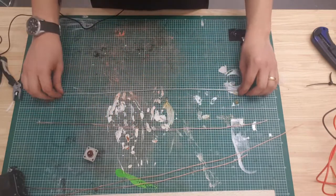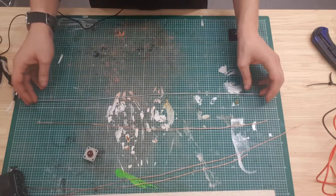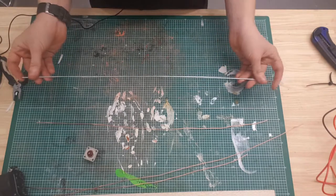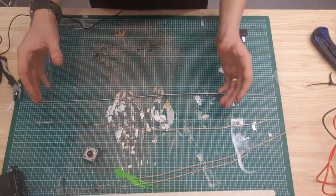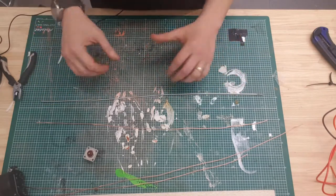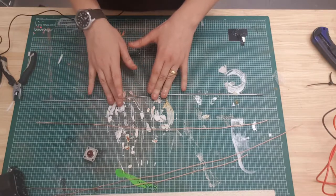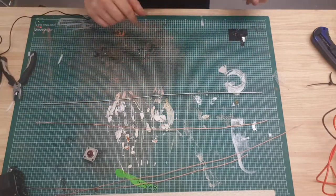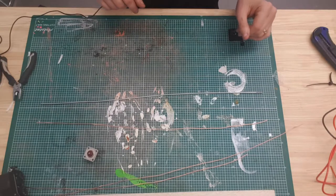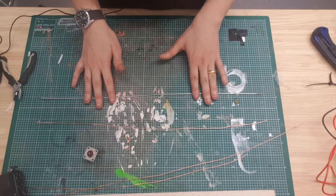Now, I was talking about calculations. This is for VHF, for the 2 meter band. Because I want it for the 2 meter band, I've made this 50 centimeters, which is a quarter wavelength. Now, if you're looking to do a specific frequency, the easiest way to get it, I believe, is in centimeters. I will annotate that if that's wrong, if it's in meters. Tell a lie, it's in meters. Yeah, that's going to annoy me. Let me check that. Yes, okay, so there you go.